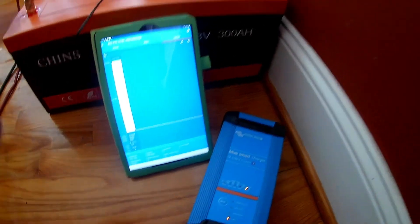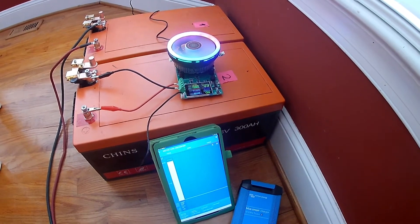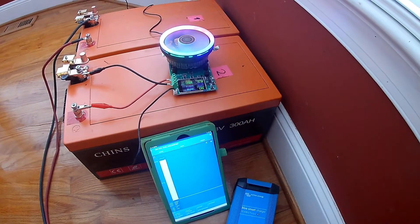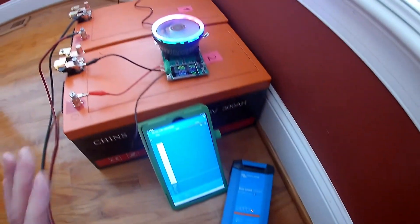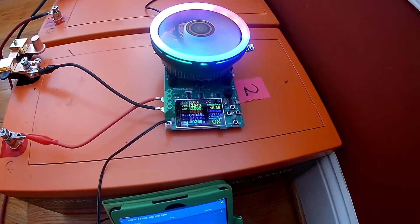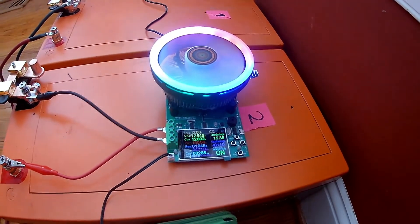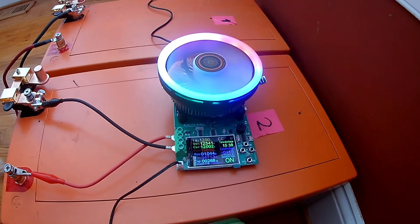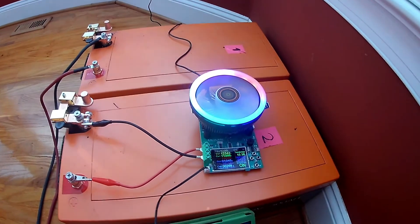Two different instruments are telling me that the first battery had 295 amp-hours, discharged down to 11 volts. I could have gone a couple tenths lower and gotten a couple more amps out of it, but there's no point. Looking at the second battery's behavior, it's looking pretty similar — I'm at 268 amp-hours so far, which is basically 90% of the battery, and the voltage remaining is 12.54. That's pretty much behaving the same as battery number one.